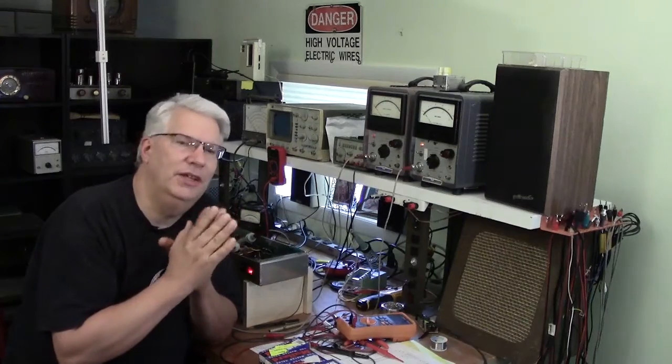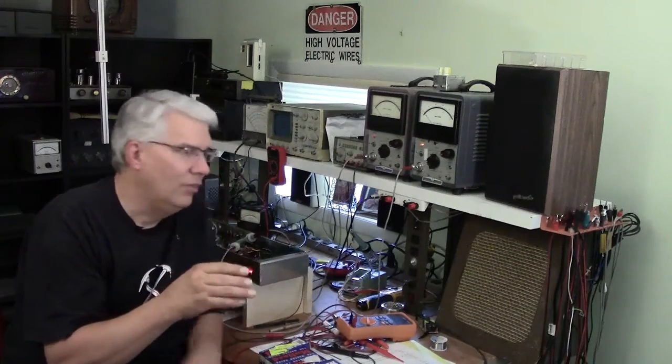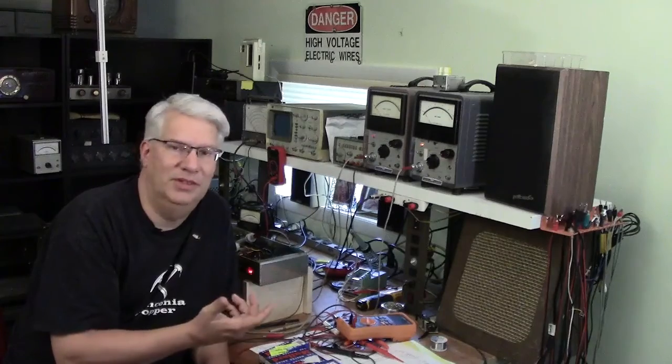When I talk to Jerry, he says he gets it down to a fraction of a milliamp to make sure that the balance is correct. Well, we're way off. We're off by 20%, because 6 milliamps out of 30 milliamps is 20%.